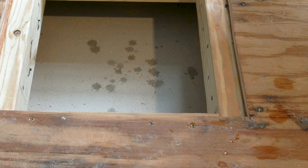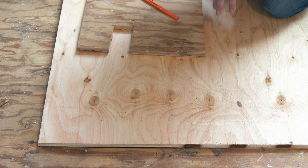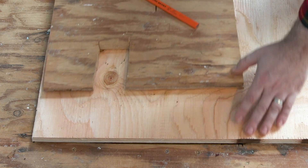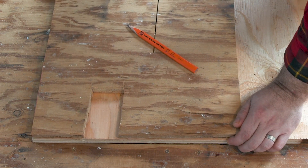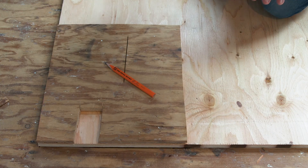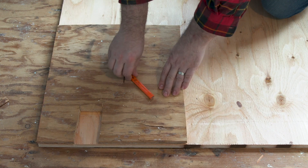Okay, that's all done. Now we just got to cut the piece of plywood, then screw and glue that down and we're done. So now that we've got the new piece of subfloor, I'm going to take the old piece that I cut out and slide it up to the corner so that I can trace out the outline of the old piece with a minimum amount of cuts.